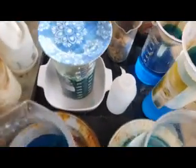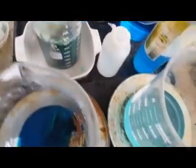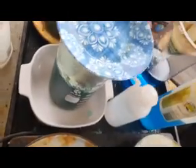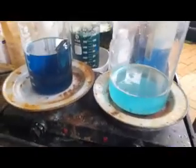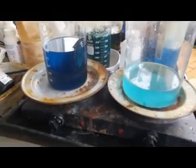And I let it sit and work, and then once all the gold is stripped off, just like I'm doing now with these, I filter it and I put it into AR. That's the AR there. This is the nitric bath. But it would be way too confusing for you guys, so I just do one thing at a time. So just boards or just pins or whatever.